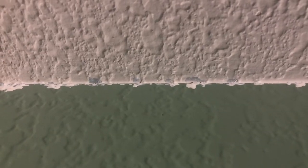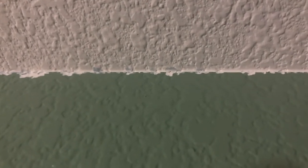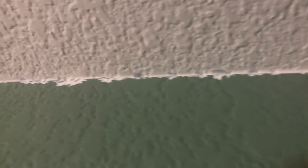After painting this wall yesterday, I found I had gotten some of the green paint up on the ceiling. Here I've already started trying to fix that issue — I masked the wall off, took some of the white ceiling paint, and painted along the edge of the masking tape. That's why there's all this white now down onto the green. What I'm in the process of doing now — pan over here — is masking the ceiling off and then painting that edge of the tape with the white ceiling paint. It'll leave a lot of white on the wall, but the green will cover that — and what it'll do is allow the white to seal that edge.